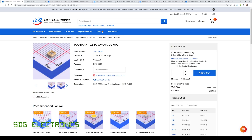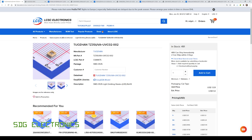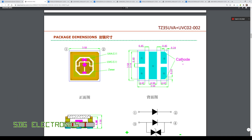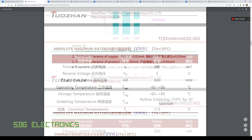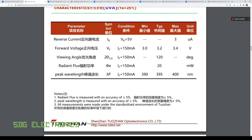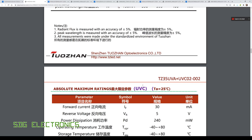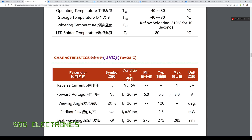This first one is a 3.5 by 3.5 millimetre LED with both UVA and UVC devices. You can see there are two diodes inside — the top one is the UVA, and the UVC one has a protection diode across it. The forward current into the UVA LED is 200 milliamps with a standard forward voltage of about 3.2 volts. The UVC is only rated for 30 milliamps and has a higher forward voltage of about 6.5 volts, with 2.5 milliwatts of radiant flux.